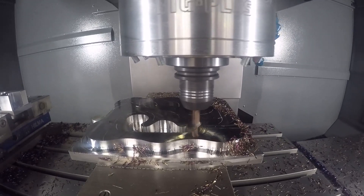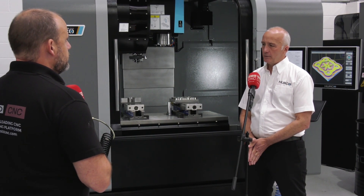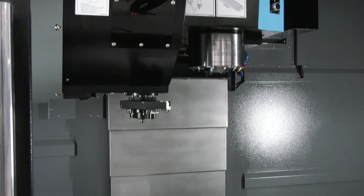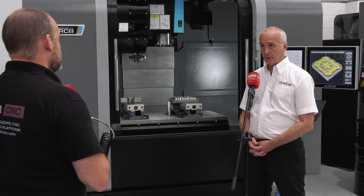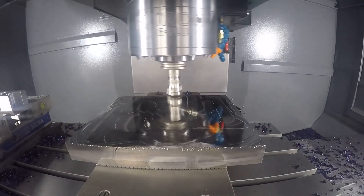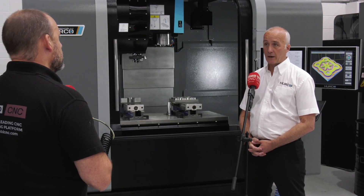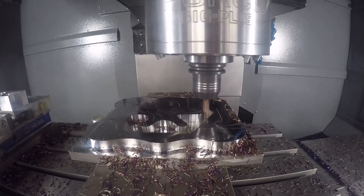Now tell us about the VMX 42 DI as a machining centre. It's a relatively new machine to our range, similar in travels to our original 42 TI model - a metre and 66 in the X, 610 in the Y, and 610 travel in the Z. There's a 15,000 rpm inline spindle with direct drives on all the axes as well. The idea of this machine is to give you better surface finish and better thermal stability, so if you're doing typically very accurate work or surfacing and looking for very good finishing on the part, this is the machine we would push you towards.